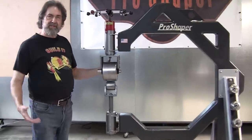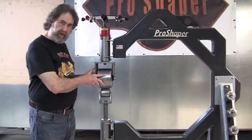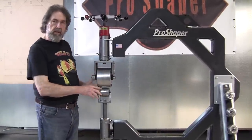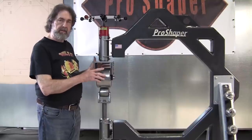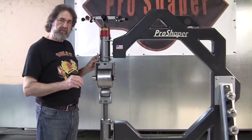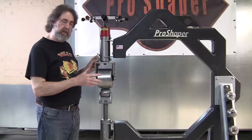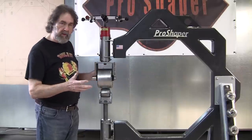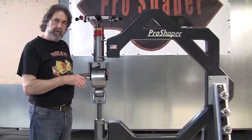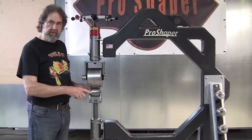The English wheel has been sitting around a little bit. There might have been some students using it. The wheels get dirty. You have to address the wheels always, meaning your wheels want to be in super clean condition, polished, because the wheel polishes the metal, or prints on the metal, as you're working it. I've shown this in earlier videos. I have like 258 videos, but a lot of people don't go into the backlog of videos, so I'm going to show this again. It's a really neat little trick.